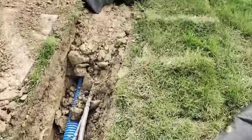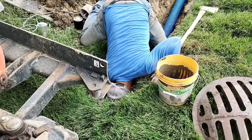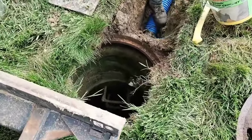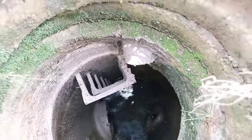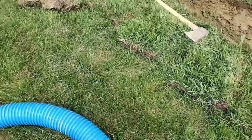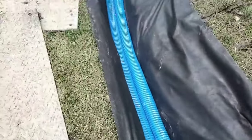You can see this beautiful inch-and-a-half round rock has a lot of void — it's going to move a lot of air. The more pipe and stone you have in your French drain, the more air you're going to have circulating through it and the faster you're going to dry out your yard. Make sure to always use hydraulic concrete when doing a storm drain core and tap on a concrete culvert pipe — this is code and required. Hydraulic concrete sets up really fast, so when you're working with it do not hesitate; make sure to mix it and put it in place. The super flexible, extra heavy-duty high octane armor pipe is ideal for yard drains.